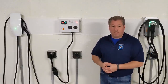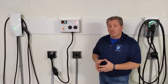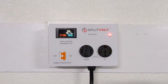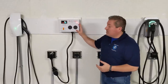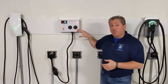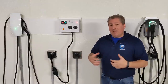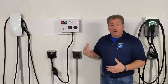So if you have an existing electric dryer in your garage — chances are it's on a 30-amp circuit — you plug the SplitVolt into your existing dryer outlet, plug the dryer into the side labeled 'Dryer,' and plug your electric car charger into the side that says 'EV.' It intelligently splits the power, allowing you to use your dryer and have your electric car plugged in, switching back and forth. When the dryer finishes, the electric car charges.